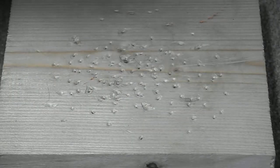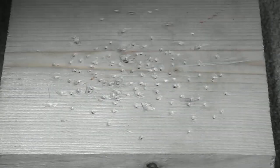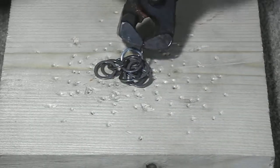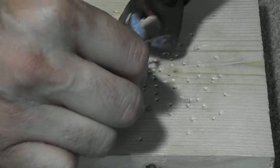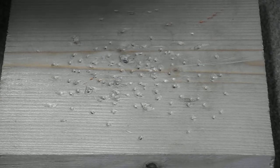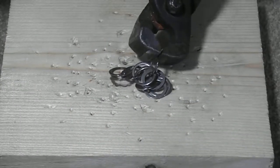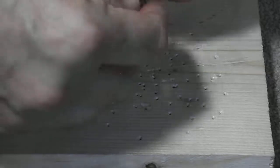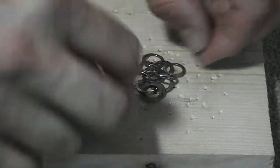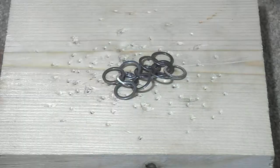put it in the same depression that you made, squeeze it in the pliers, so that it's sticking through. Put it in the center depression and peen it over. And now you've got the beginnings of a long chain of mail.